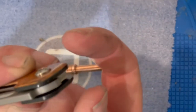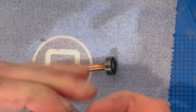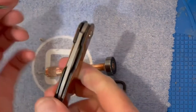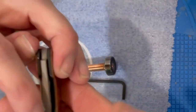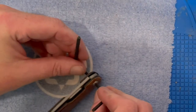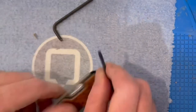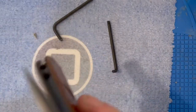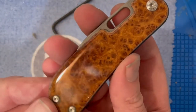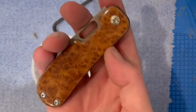The blade is really loose too — this isn't fit up really well, but the geometry seems to be working. What I need to do is take out this pivot and sand down the barrel a little bit. Actually it's pretty darn good — get it on the table, two wrenches, just take it a little bit. Wow, this is awesome — what a good looking knife, holy moly. Let's take it outside and give it a good look.